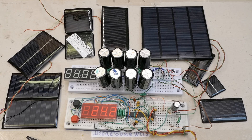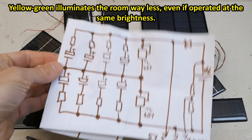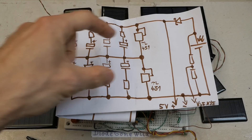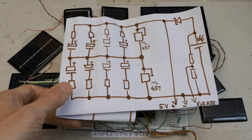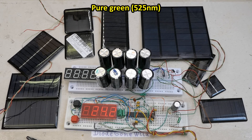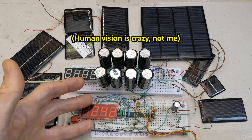The yellow-green is still better visible from a distance and also doesn't illuminate the whole room. To use the pure green display I would use a configuration with two series groups of capacitors charging up to 5 volts — I already tested this and it works well, it's better from an efficiency standpoint. But I just personally don't like the green display: it lights up the whole room even when dim at night, whereas the red display can be bright and still not light up the room.